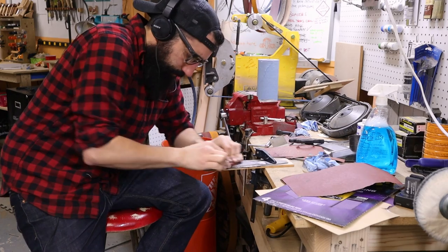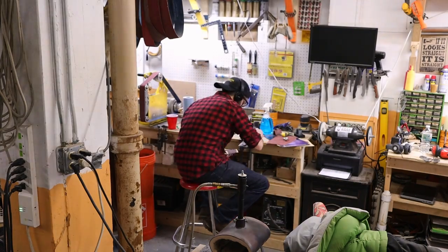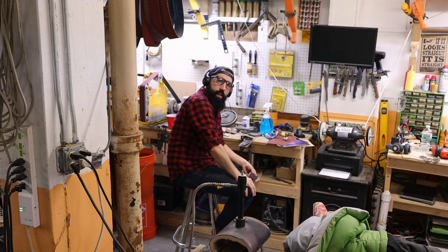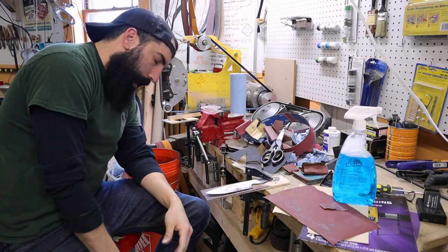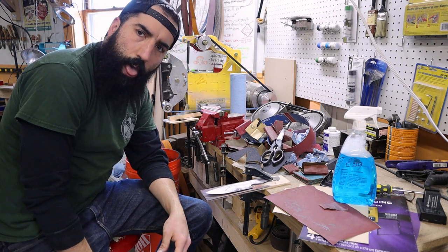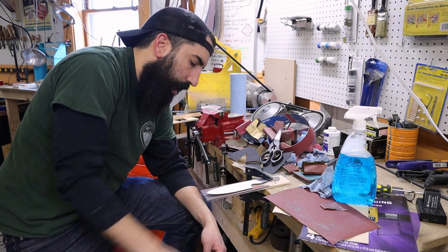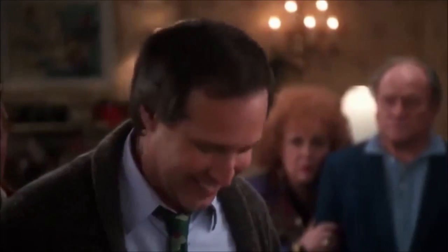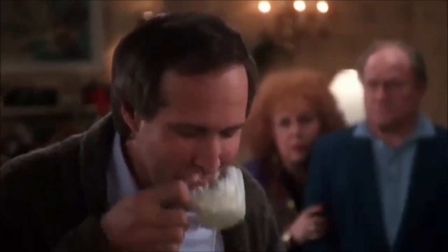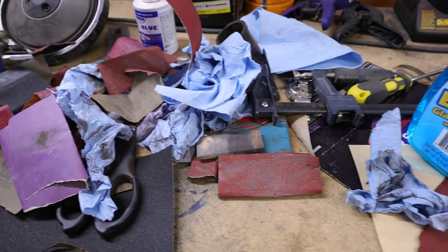Because I'm going for a stonewash look for this blade, I'm starting with 100 grit and stopping at 220. There is a process on how to properly sand a knife, and I'll leave that down in the description below. Approximately 10 hours later. I think I'm done. It's good. Be prepared. This process is going to take a lot of elbow grease and even more sandpaper.